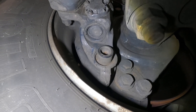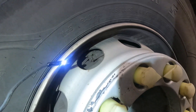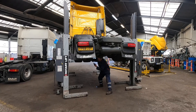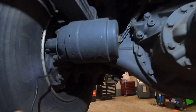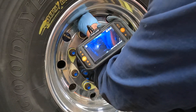This is on the DAF XF on the rear axle, and this is on the DAF LF on the rear axle — the brake calipers are in a different position. Same with the front axle brake pads on the steering axles. You can see them, but it's better to use a tool to access them very quickly. Otherwise you're going to struggle, and most guys do, trying to work out the depths. The brake pads on the rear wear out quicker. This is the mirror, the round mirror we use, and this is the tool added to the service instrument arsenal — just as easy as that.